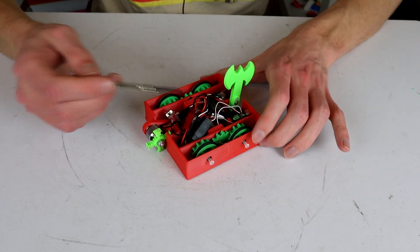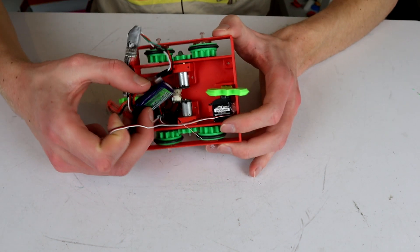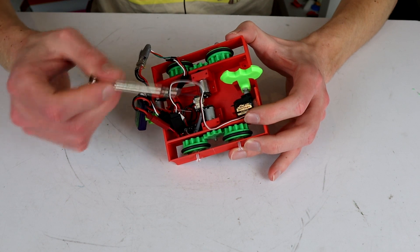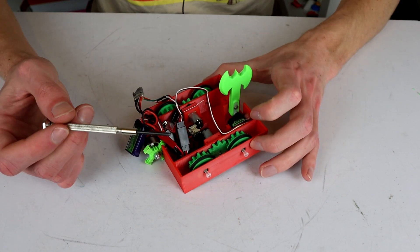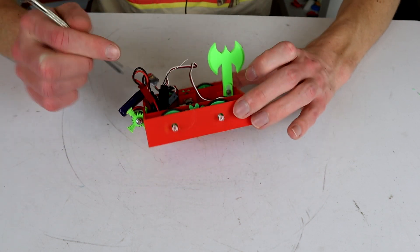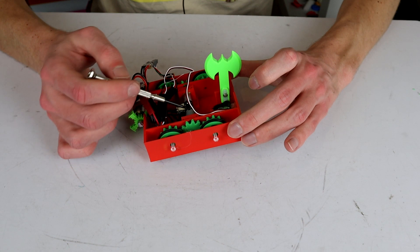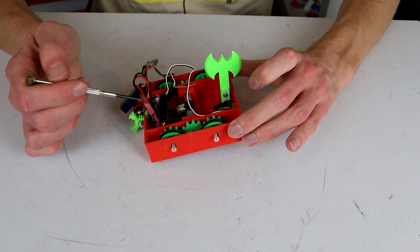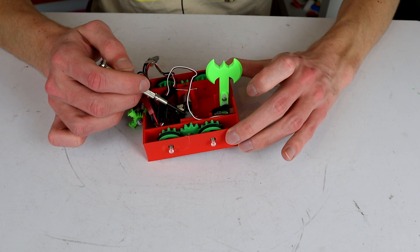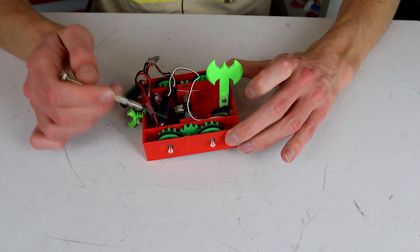The first thing I wanted to do: at the moment we have two N20 motors in here — two DF Robotics N20 motors in the middle — which are a nice light solution for doing this type of thing. These guys, not the greatest. Basically because at the moment they're driving a gear, which is then driving the two outer wheels. So compared to my original control system for robots, this comes in backwards because the gear turns the wheels in the opposite direction to itself. So all of this stuff is a little bit messed up and it doesn't actually drive correctly.